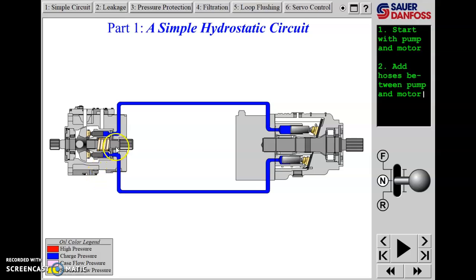The pump is an axial piston pump, variable displacement. There's a swash plate, and there's the barrel with the pistons, the spring that's putting tension through the ball guide and the pins to the retraction plate.